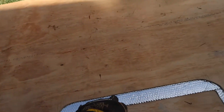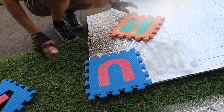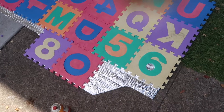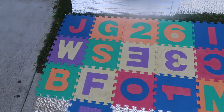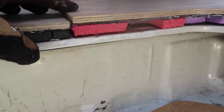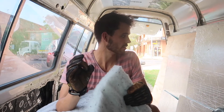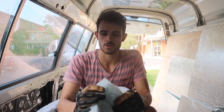We have two sheets finished and one more here with some overlapping material, which we're going to cut off with a razor blade. The layers fit in and then get stuck onto the board — first the reflectics, then the plywood. I've got more spray glue and some insulative wrap — basically a thin, non-glass-particle version of fiberglass wool. I'm going to cut it to shape and fit it within the panels we removed.